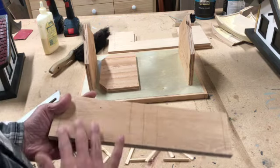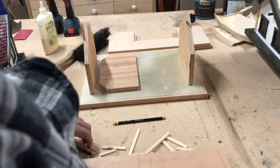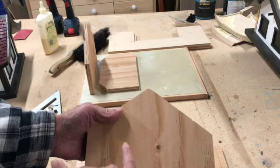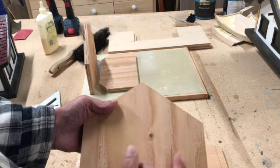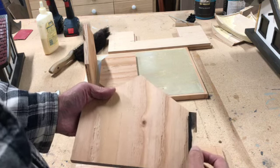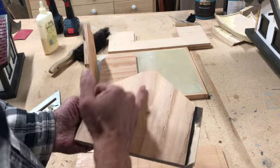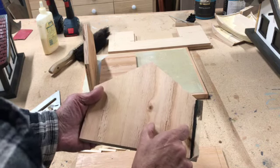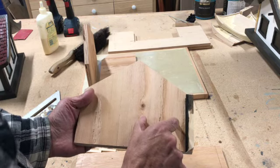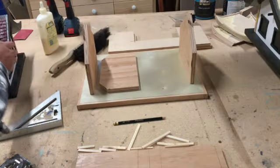Once you get your front board trimmed out, just your front board, not your back. Remember, we're not doing the back panel. Once you get your front panel trimmed out, you're going to take your gable end, and remember you'll have a bore here, and you'll probably want to outfit a couple windows here, again, using this to determine how far in. You're going to have a center line here. You don't want to set your window too close to this edge. You want to make sure you're a little ways away. So that gable end might look like something like that.